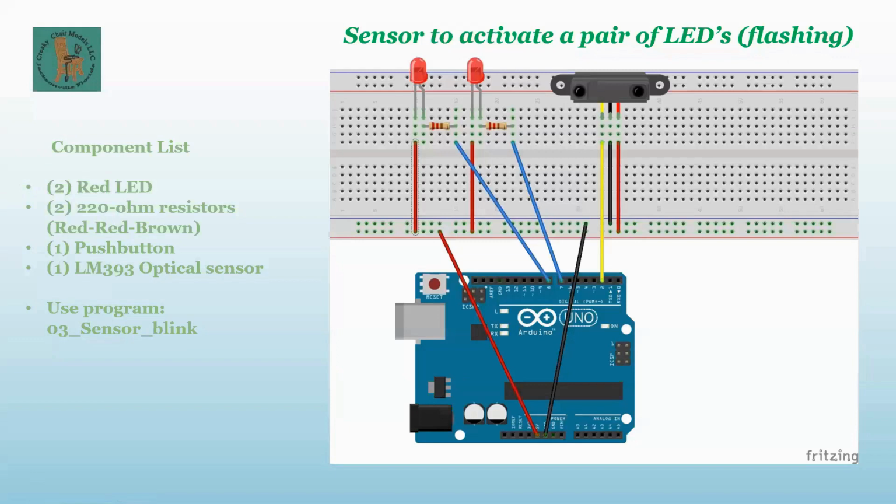You can substitute any of the sensors that have an output. Even the analog ones, the reflective ones, if that's what you got, you can hook it up to this. It doesn't really matter as long as it's got an output. In this case, just remember on those analog reflective ones, you've got to have a pretty defined reflection. One of the problems, and I covered this in my YouTube video on them, is they don't reflect off of matte black hardly at all. So you've got to have them pretty close to the actual device that it's going to reflect off if it's got a flat finish at all. And guess what? 80% of our steam engines are flat finish black, maybe higher, but I would say 80% at least. So that's where the problem comes in with them.